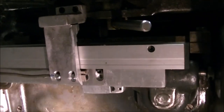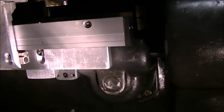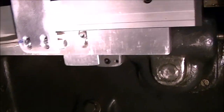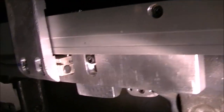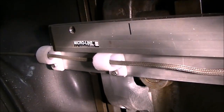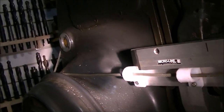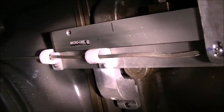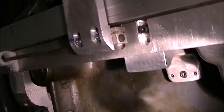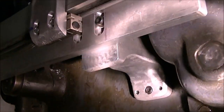So that's the Z axis and here's the Y axis after everything is all done. As you might notice I switched the cable out to the other side of the reader head. And so it goes out the back through a couple of nylon guides to kind of help keep it from kinking or catching on anything or abrading.